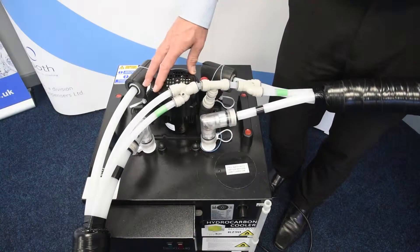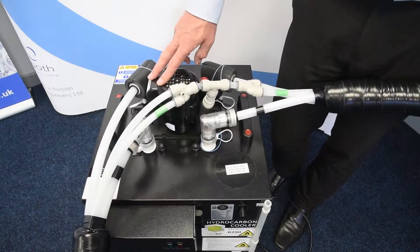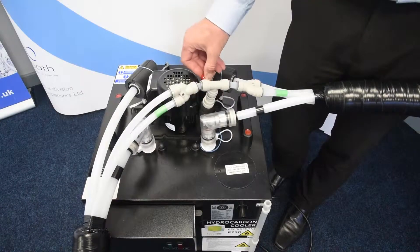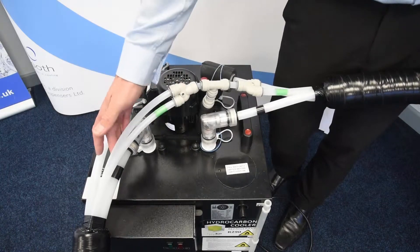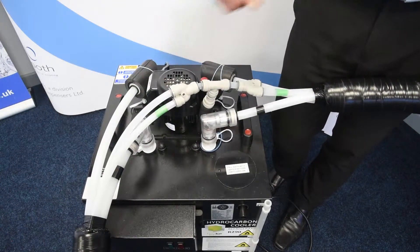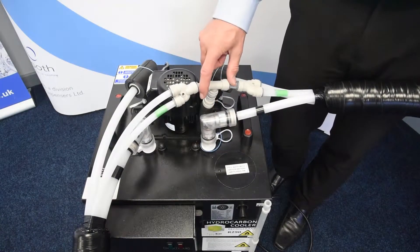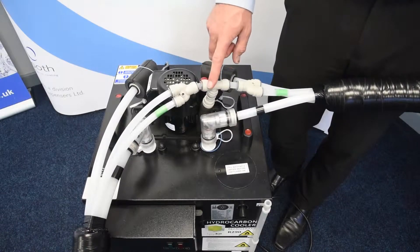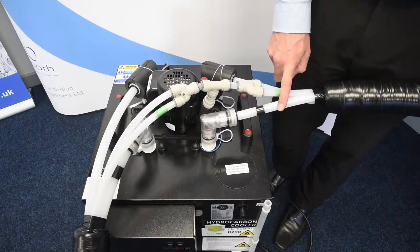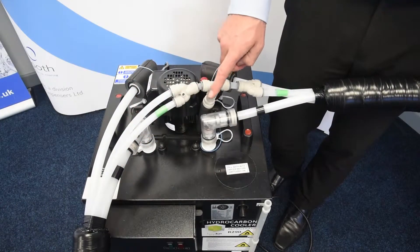The first area we'll look at is the top pump. This is an area of great confusion — people try to use the return on the top pump for the water going back into the bath. We do not use the return, so leave the red cap on it. The return water comes back into the cooler via the coaxial python through the fitting and back into the bath. It's set up here for two products — the flow comes out from the top pump and we need to split it: one side goes down to the keg connector and returns back up through the coaxial into the bath; the other side we're pumping out to the tap and coming back through the coaxial fitting into the bath.